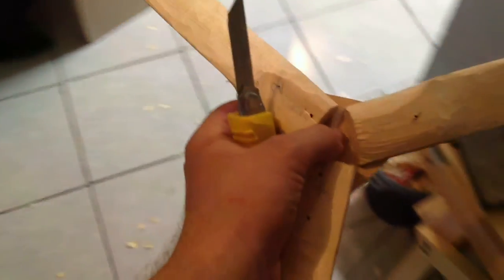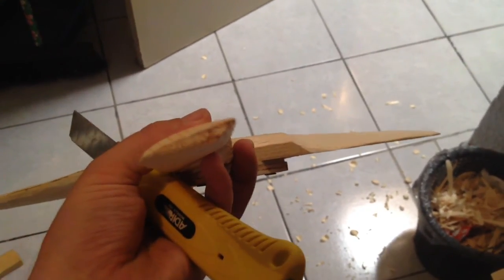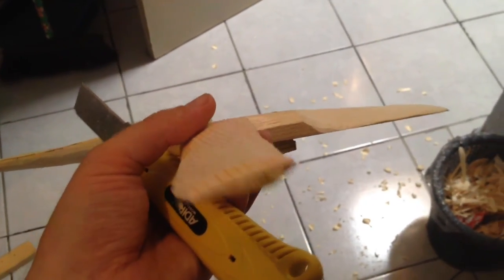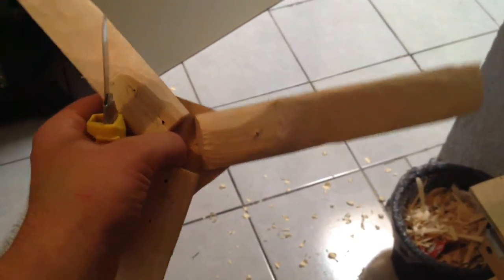Now I take a little piece of wire and put it in the pivot — the heaviest blade goes to the bottom. So now I'm taking more material off. I left the top surface curved, but only the bottom surface is supposed to be curved for an airfoil to get that efficiency. I left the top surface pretty fat, so now I can take off material from the blades. I keep statically balancing them until they're all balanced, and then it won't vibrate too much — all that vibration is stealing your energy.